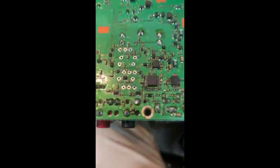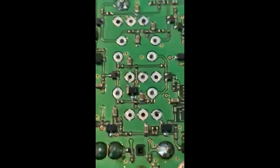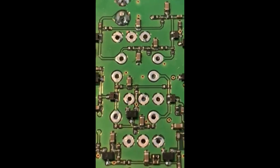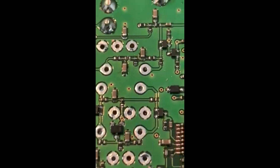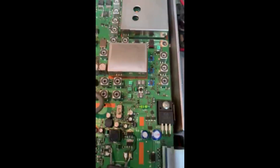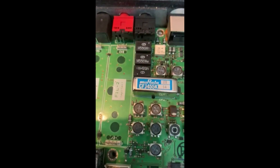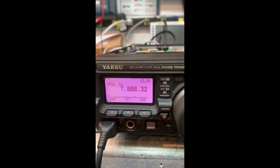We're at halftime — the filters are out, the plated through-holes are all cleaned and prepped, and ready for the new filters. Everything's got to be nice and clean and the holes open, because those little tiny tabs can easily be folded over if the holes aren't open and you'll think the filter is connected when it's not. Here we have the new filters installed — I've tacked the PC board down in place just to test it electrically first. Here we are in CW mode, just like before.